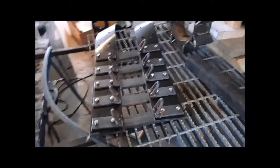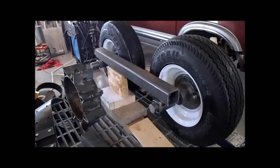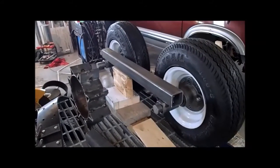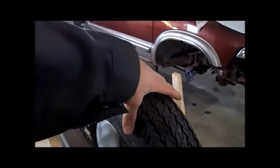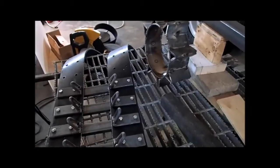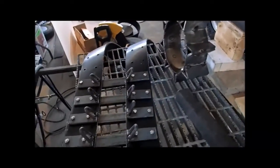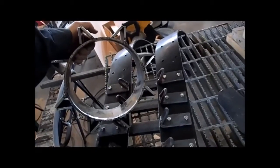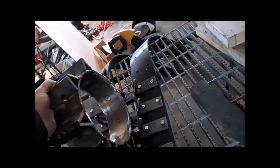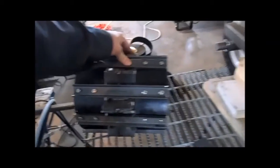This is the track and the drive sprocket, and we've also fabbed up — just tacked together — a little walking beam, just to see how it would sit and to understand where the track, once it's laid on top, how it will fit with the cleats there, and the spacing we'll have for the track and the walking beams to tilt up and down. Took and divided it in eight pieces, put eight triangle-shaped cogs on, and the cogs line up really well with the track.